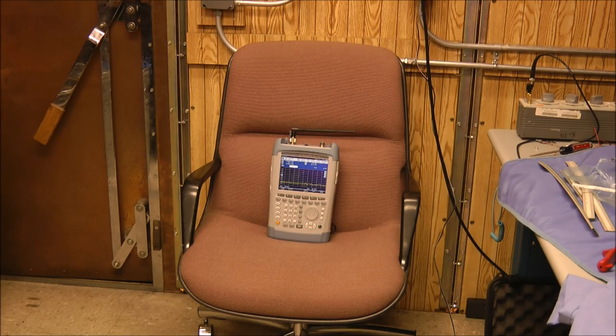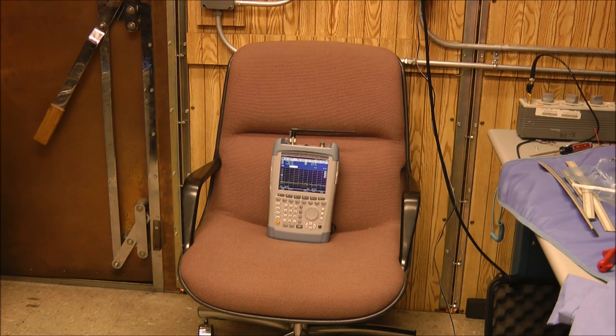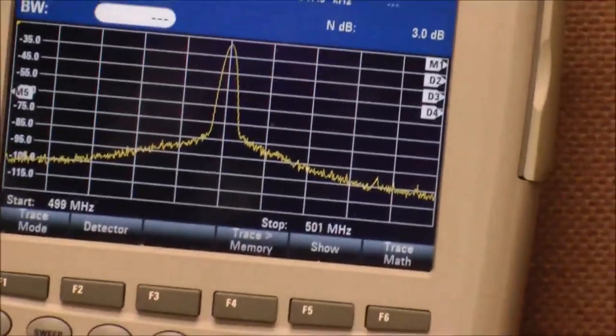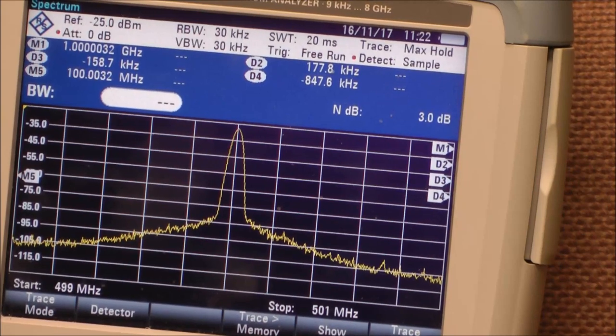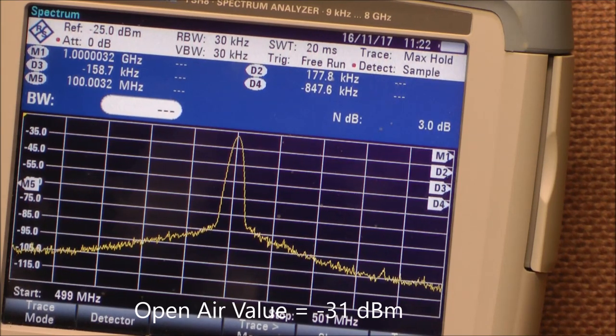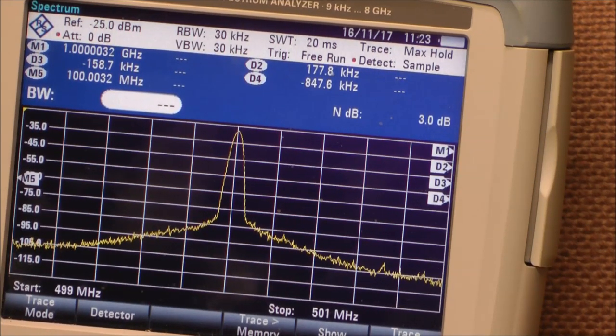The first thing we need to do is conduct an open air test. I've set up a frequency generator and amplifier to run at 500 megahertz and set the spectrum analyzer up to receive the signal. I've bent the antenna sideways so that it will fit in the ammo can for the experiment. Let me go ahead and turn on the signal generator — we should see the level rise up on the spectrum analyzer. I centered it right at 500 megahertz, and it looks like it's about minus 31 dBm. That would be the open air value of minus 31 dBm.